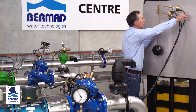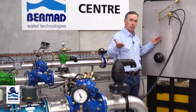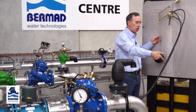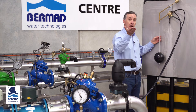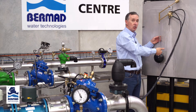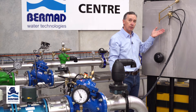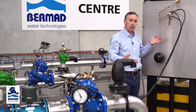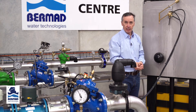If we now put the float down, that means we want the valve to open. The inlet water pressure from the pressure port flows under the diaphragm and the water coming off the top chamber vents to atmosphere. Once we've done one complete stroke of the valve, we're confident that all air has been released from the control lines and the valve is ready to be set.